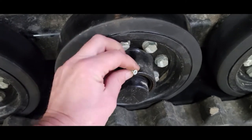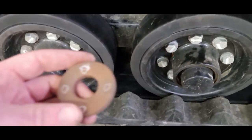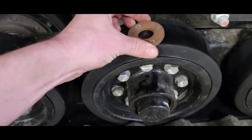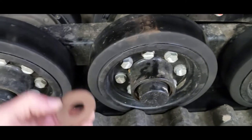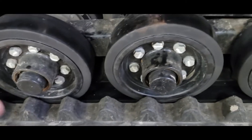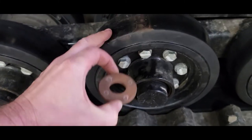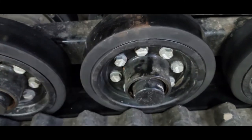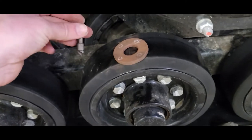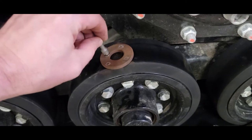It's real easy. If you hit metal, just shift the washer over so you're missing the metal. Make sure you put your silicone on the backside, sandwich everything back together, and screw the washer to the back of the wheel. That's it — that fixes pretty much the flaw in the original wheels. The hardest part is basically getting the hole countersunk. You can try just putting a straight hole through, but if you countersink them there's less chance of busting the head off the screws.